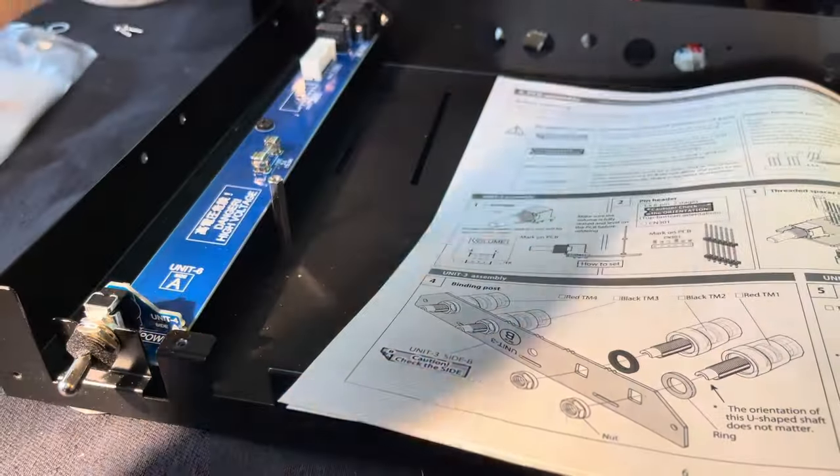On these sockets, for those who aren't familiar, you'll notice two of the pins are fatter than the other two pins. So they only go in one way. You want to handle these big tubes by the base — you don't want to grab it by the glass or you risk literally breaking the glass off the base. Not only could you get hurt, but you'll wreck the tube.